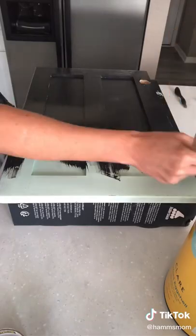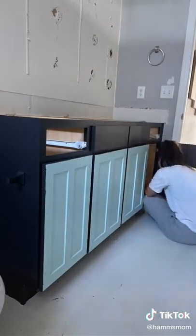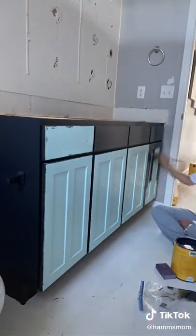This is what the entire cabinet looked like with just one coat of paint. The way that I like to refinish cupboards is to take off all of the doors and paint the sides and the entire back piece. Then, after all of those are done and dried, I reattach them and paint the faces. I find that this is the easiest way to do it.